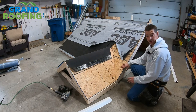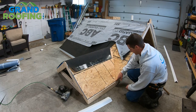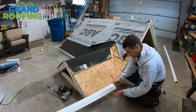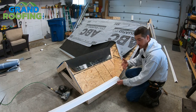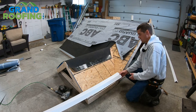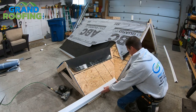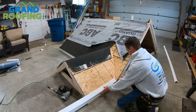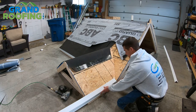It's not often you come into a fascia board and a gable that terminate with a valley. In that case, it's fairly important — the way water flows downhill, you just want to think about which way the water would go, so you lap things correctly. In this case, we're going to take this apron and cross over the valley a little bit by removing the top side and letting the bottom hang over just a little bit — it doesn't need to be much.